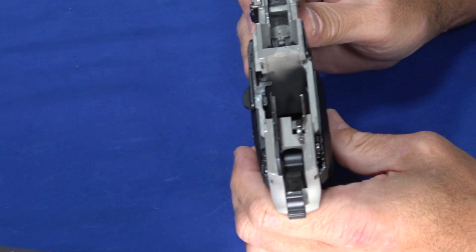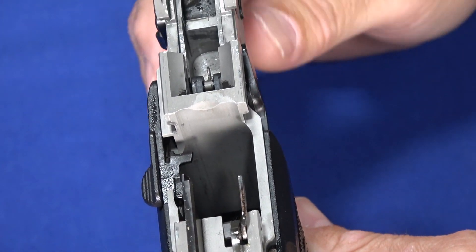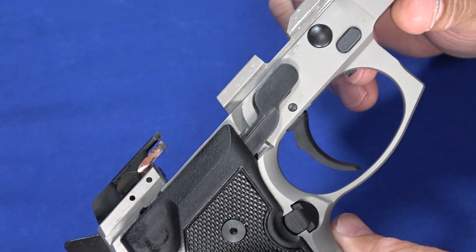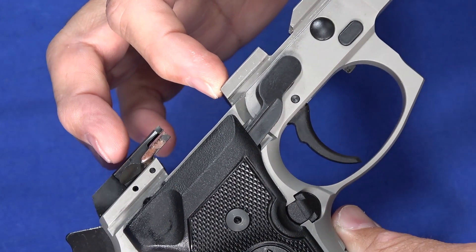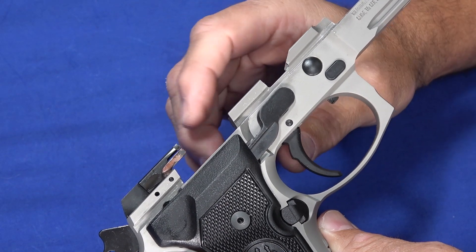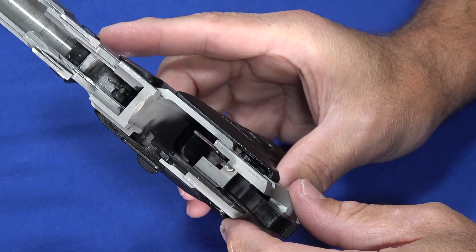The frame is very similar — because it is pretty much the same as the entire 92 series, with the minor revisions from the 92 to the A1 and on down the line. You have a partial feed ramp in the frame itself, and very robust guides all the way across. These have kind of a split guide with a little gap, and that's part of where the locking block mechanism is. You've got very long, thick guides at the front and the same at the rear. Part of that is to allow for looser tolerances so it can deal with harsh environments while still being strong and robust. Other than that, there's really not a whole lot going on in the frame — it's actually a very simple fire control group.